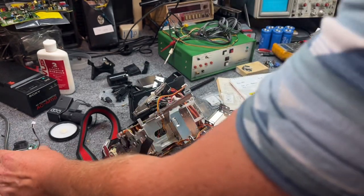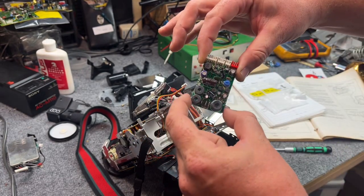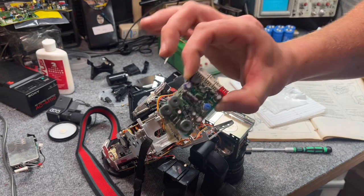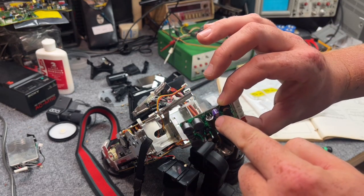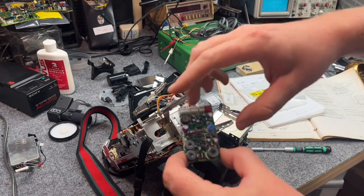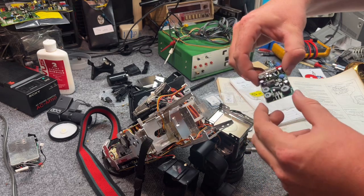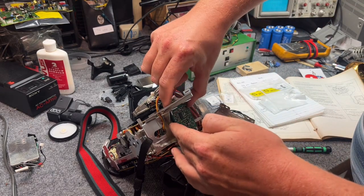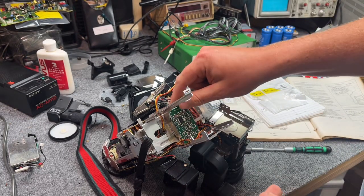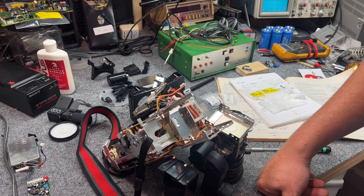While you're in there, this is the DC-to-DC converter, and even in the manual they give you no schematic for it — just a parts outline. It is filled with electrolytic capacitors, including some Sanyo units that are a known issue in the 5000-series Betas. This one still needs a few more caps ordered, but it mounts right behind the CCD board in the shielding. If you've got the lens out, now is the time to tackle it, because if this starts acting up you'll have all sorts of problems and this camera is not fun to trace issues on.